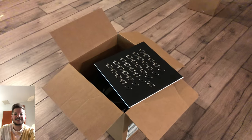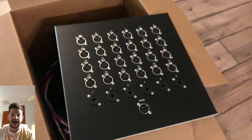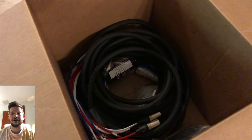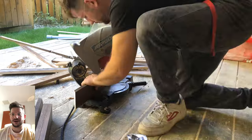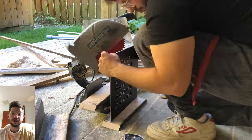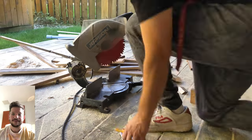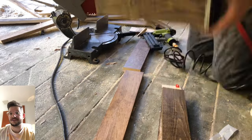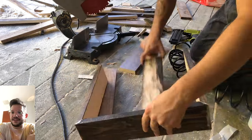Chapter seven is the custom wall plate box. This client got this custom plate built — it's going to be mounted on the live room side so the client can have all of his inputs and outputs easily routed to the live floor from the control room. That way they can set up whatever microphones and do whatever routing they need while recording in the live room, with everything routed neatly into the control room. To mount this custom plate, we are building a custom box to house it, mount it to the wall, and then the client is going to do all of the soldering himself to finish up the connections. I'm cutting nice 45-degree miters — this custom wall plate box was a 13-inch square, and I'm using the same 1x4 pine we used to trim around this job.